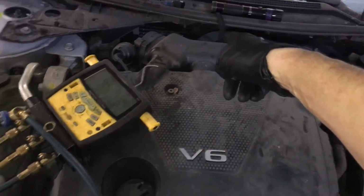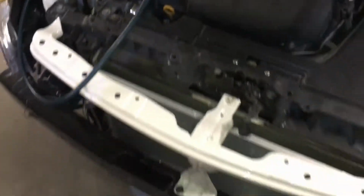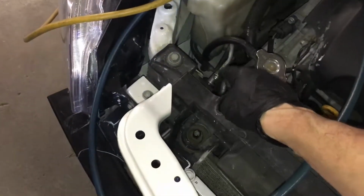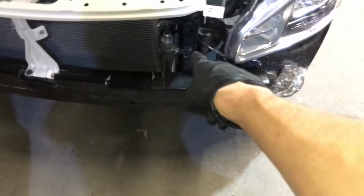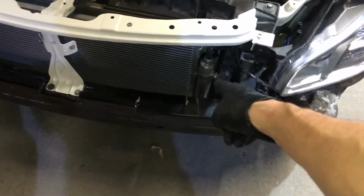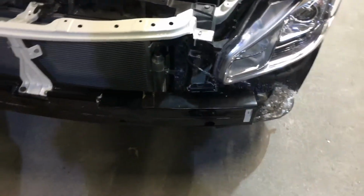So they're gonna have to order a new line, replace the new line, going all the way back to the expansion valve, and then I come back and charge it up again. And that was because it was missed the first time by the technician. And this is the one where I replaced the technician who put Teflon tape trying to seal it with no O-ring.